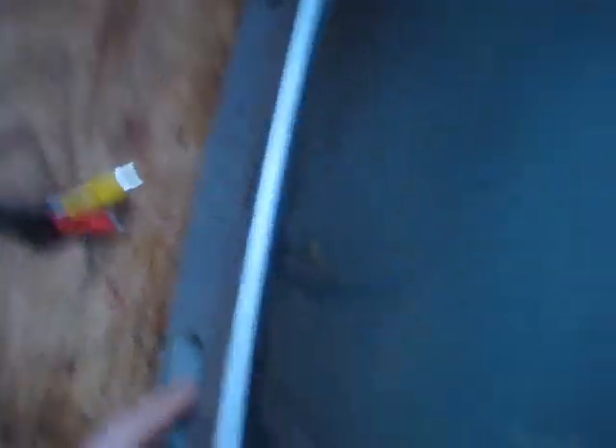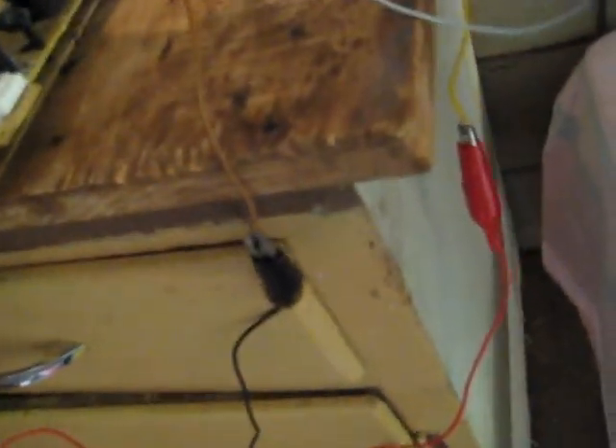Very careful — I push it in on the plastic where it's insulated. I'll reconnect the set-top box and we'll see what the picture looks like. If it's successful it should turn on. We've got it on there — plugged something wrong. As you just saw, it blew the TV's horizontal transistor. Once that happens, she's done. But I don't really care anyway — it's only going to get sent for recycling. It's not worth fixing as I said earlier.